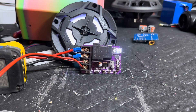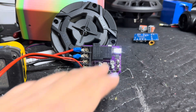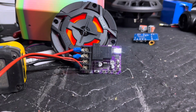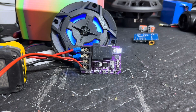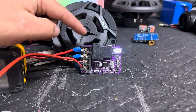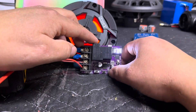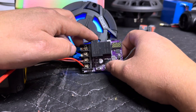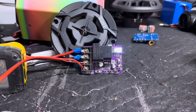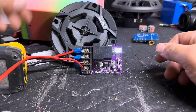There it goes — 17 — it just cut off. It's at the threshold so it is going to cut on again, but normally you'd draw a little more power than these LEDs. These are 5-volt LEDs, which is why you want your CH higher. My CH is 18 — I should have put it at 18.1. So if I change that to 18.1, now they'll stay off. After 60 seconds this will cut off and you're good to go.